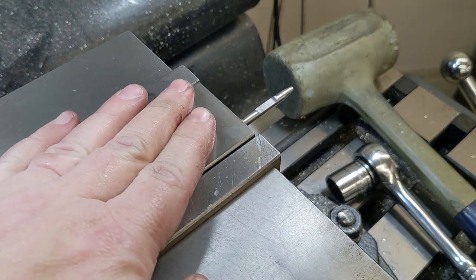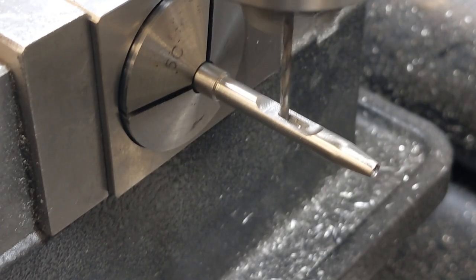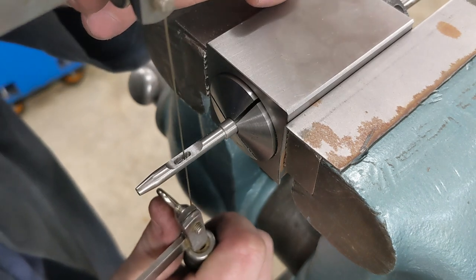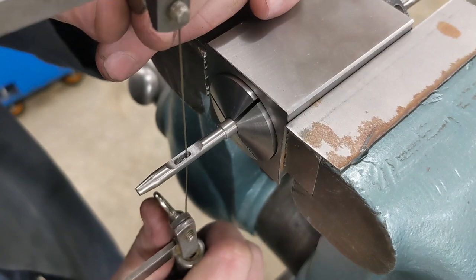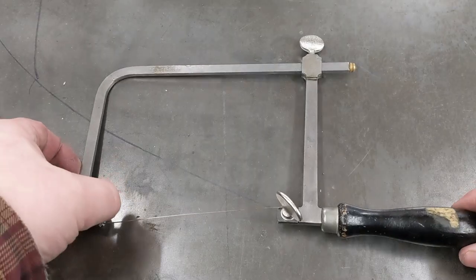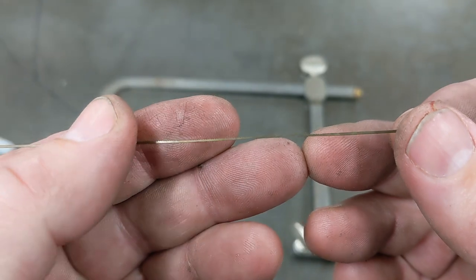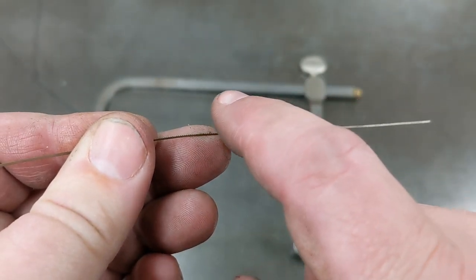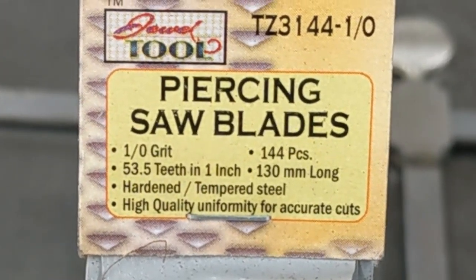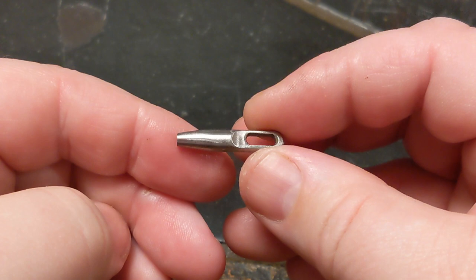Then, flipping it 90 degrees, I started to carefully mill out a 2mm slot. But not carefully enough. Blast. I drilled out what remained of the slot in three places, then pulled out my old secret weapon: a jeweler saw. I don't use it much anymore, but before my shop had so many serious machine tools, it was a vital bit of kit. I always recommend jeweler saws to people trying to get started making stuff in metal — a little drill press, a jeweler saw, and some good files can get you a long way if you're patient enough. They're like tiny hacksaws that can cut very fine and precise holes in thinner material. The blades are incredibly fragile, so expect to break them regularly — there's a reason they are commonly sold by the gross. Then it was just a matter of filing and sanding everything to be as clean and smooth as possible. I wasn't entirely happy with the inside of the slot, but otherwise I think it came out pretty well.